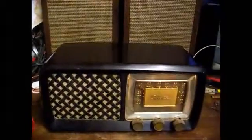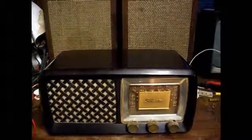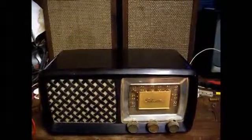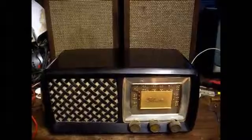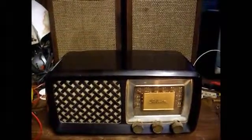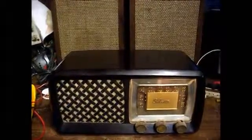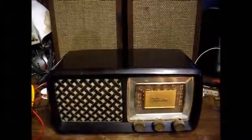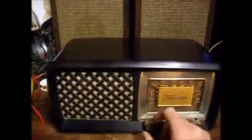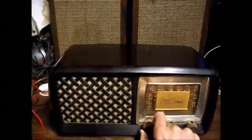Even though this radio has a tuned RF stage, I really can't see that it performs any better than many standard AA5 radios that I get. That means All-American 5 tube lineup, for those that don't know. And I've actually ran into that a lot. In fact, I've ran into some 5-tube radios that performed better than some 6-tube sets with the 3-gang tuning capacitor tuned RF stage.